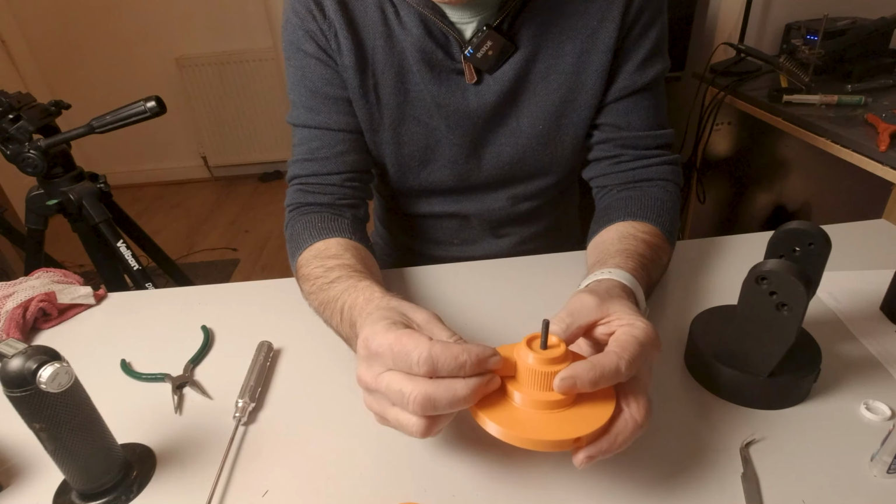So if you look at those parts, the 2 with double holes in here are for the ends. You'll notice the other ones only have a single hole through the middle, like so. So they go in the middle like that, and the two ends come on. One of these has a pocket in it for the head of the bolt that's going to go through. So I'm going to put these together like so, and I'm just going to take my M6 screw and use that as a guide for these and run them onto here. Okay, and they'll all line up like that.